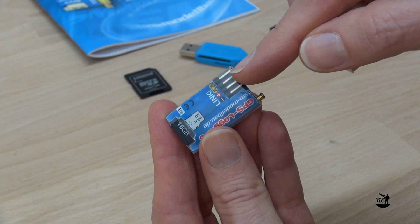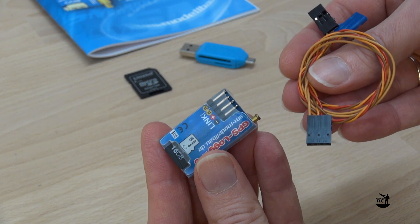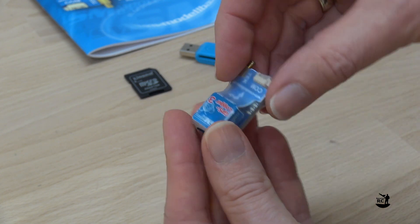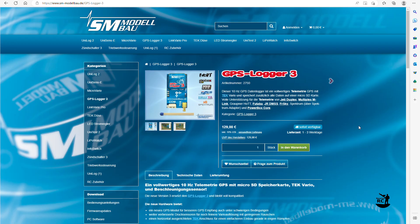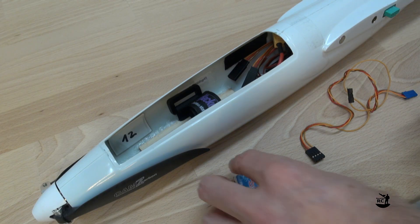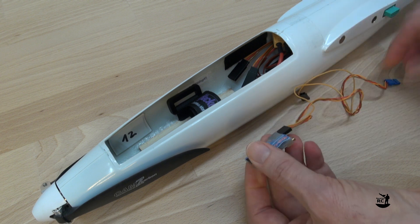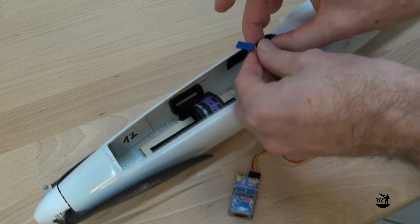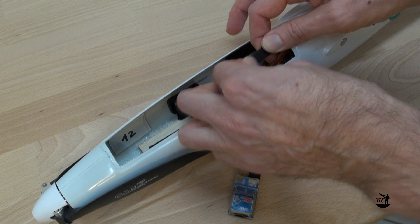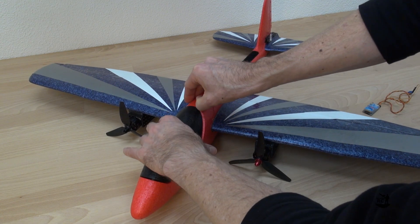The link connector is for telemetry and power supply, connected via this cable to the receiver. For more info, check out the manufacturer's website — I'll put the link in the description below. In most cases you would want to connect the logger directly to the telemetry channel of your receiver, like in this example with my triple NEO. Nevertheless, I sometimes found that I would need to use it in a standalone mode.